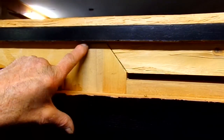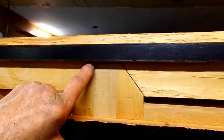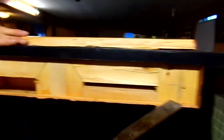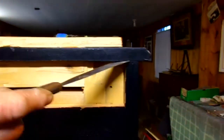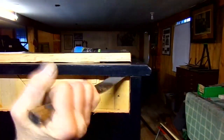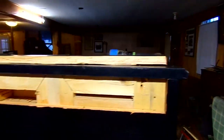It almost looks like this moved here — some of it's caused by shrinkage. There's a little space here; it does go in there. See that top is loose a little bit there. We'll wedge this open as much as we can, get it all good and hot, and hide glue everything thoroughly.